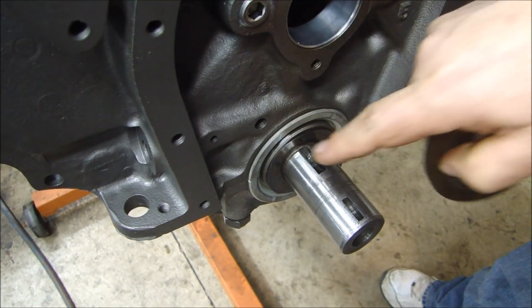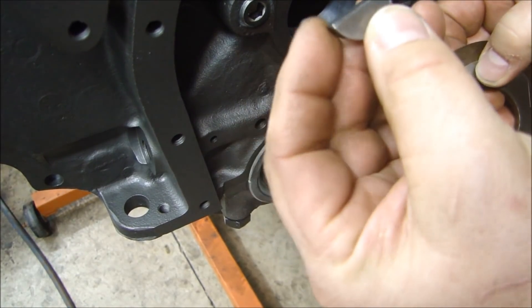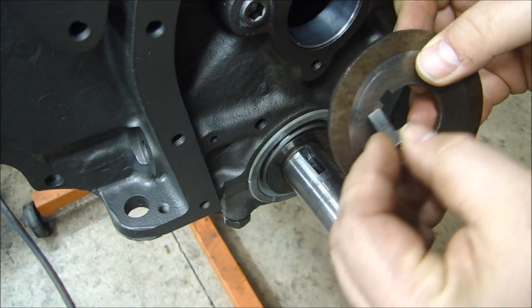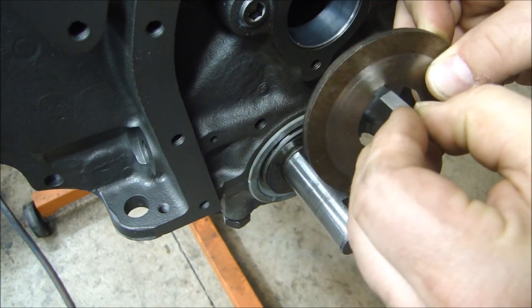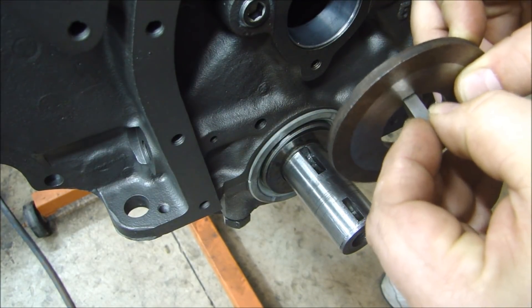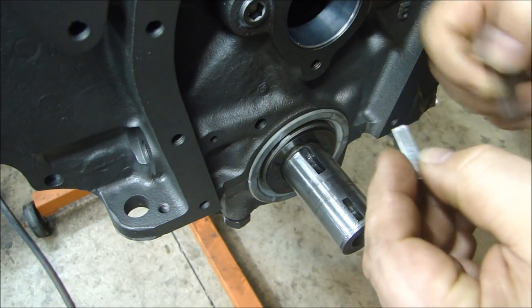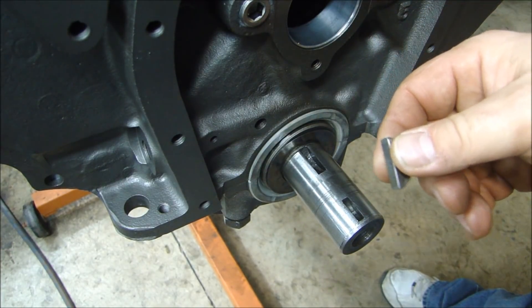The key goes in the slot here. And to make it easy on yourself, before you put your key in, depending on how you took it out, you want to make sure it's not damaged. Just run your key right through the part to make sure that there aren't any sticky spots and it works nice and smooth. The reason you do that is because you don't want to put it on there and end up swaging or ruining your key. The key is fairly soft.